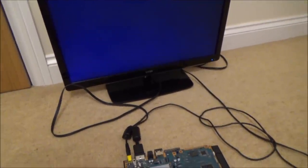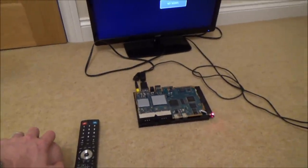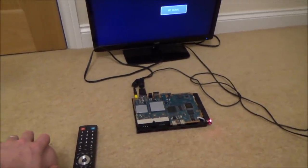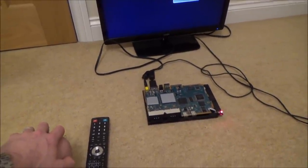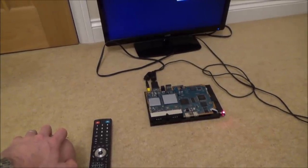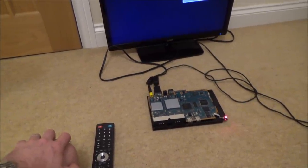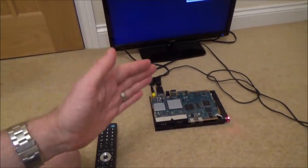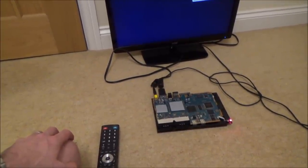Okay, that's the first time I've got it to turn on, but remember Ash did say that occasionally it does turn on. So what is that about now? I'm really not sure what to do on this one. I think I'm going to take off that chip and have a look underneath it, because that's not a BGA chip, and at least then I can trace where the route goes off that video output, and that will give me a better idea of where it ends up.